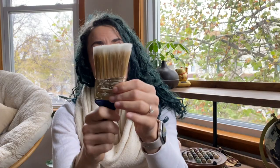The last tool you'll need to paint is a brush. This little brush here I've had for about four or five years and I've taken really good care of it — the bristles are still nice, not frayed. I recommend this brush if you want a professional-looking paint job. The angle on a brush allows you to get close into corners when cutting in around windows, trim, baseboard, or any tight space. The two-inch width helps you fit into smaller spaces. When using a brush it's about being precise and accurate, so get one that feels like a good fit. Holding a brush can hurt your hands especially in a larger home, so I like one with a flexible handle — it also helps for fitting into tight spaces.